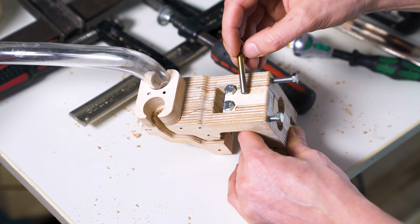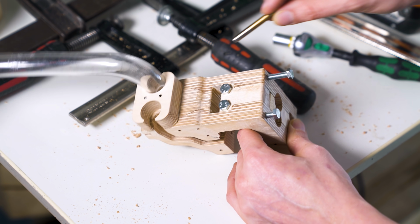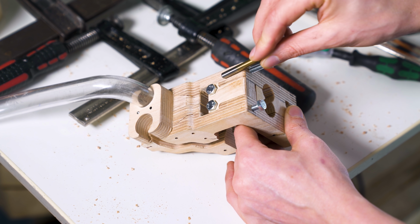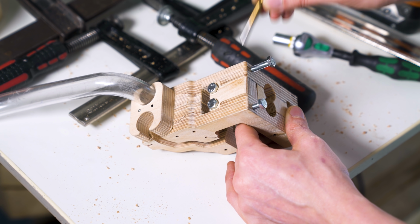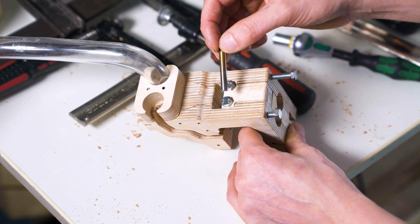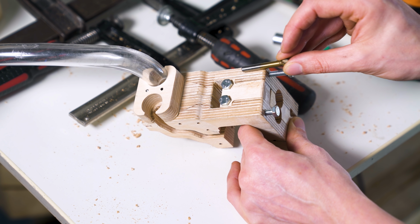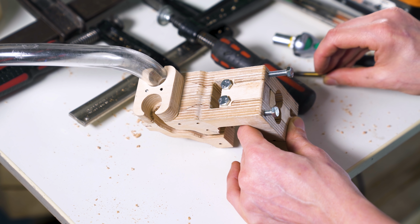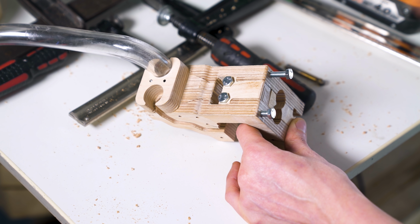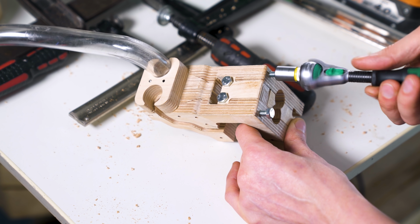Here I put a metal thread cross grain of the plywood that is much stronger. Here I had to put it alongside the grain. I'm cringing a little bit more on these screws and nothing at all on these. I'm gonna give you half a point if you thought putting the threads along the grain looks a little suspicious. You have to really look at it on a case by case basis. And in this case, it works great.